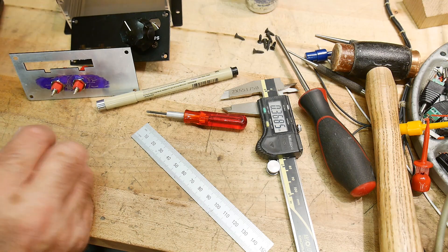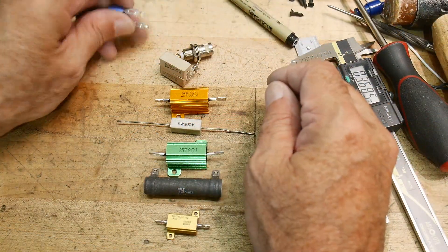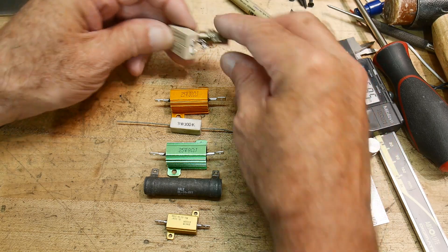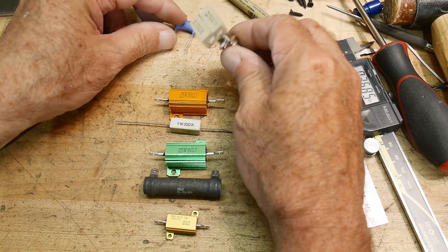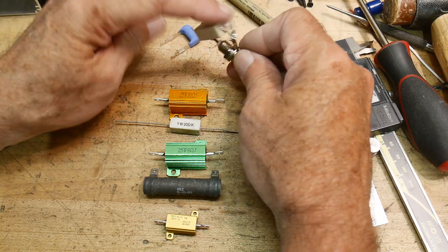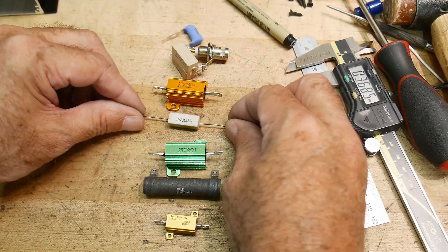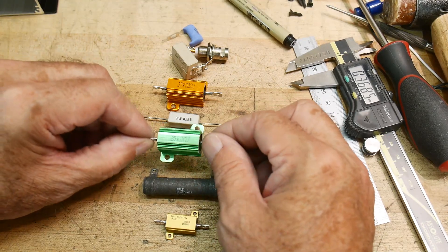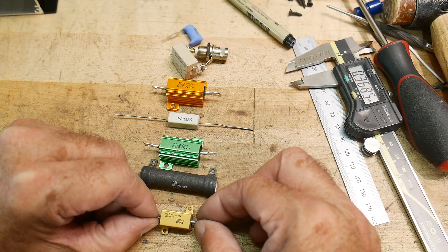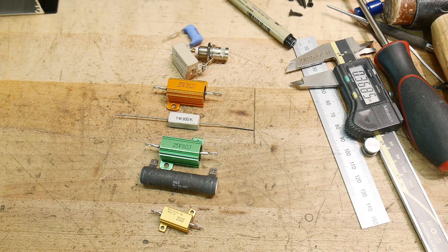Let's pick out some resistors. I'm going to start out with 100 ohms. And I've built this before on camera — this is a 50 ohm load, 200 ohms in parallel, so I'll just steal that out of there. So we'll go from 100 to 50 to 30, this is 10. I thought I'd put in 8 ohms just in case I do any speaker thing — a 25 watt 8 ohm. This is 1 ohm. And this is 0.4 ohms. Those are the ones I'm going to put in there. Let's get it wired up.